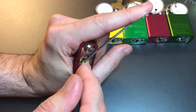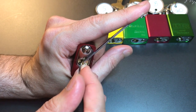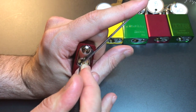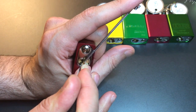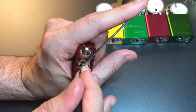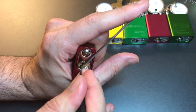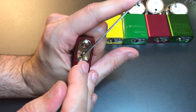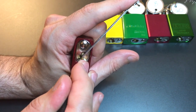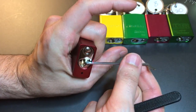Click out of one, went to a false set. Little movement on two. Counter rotation on three — got him set. Four, nothing there. Or on five. Back to one, nothing there. Two, counter rotation, and that opened the lock up.